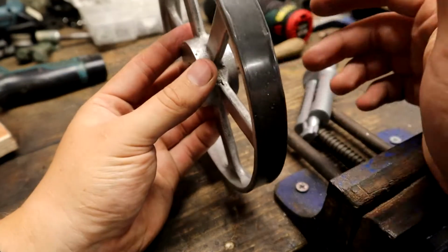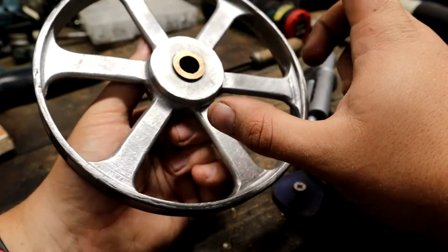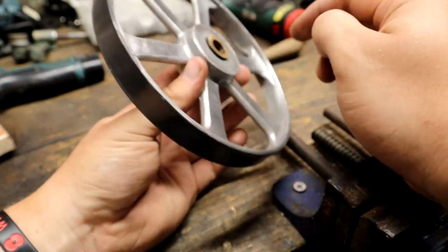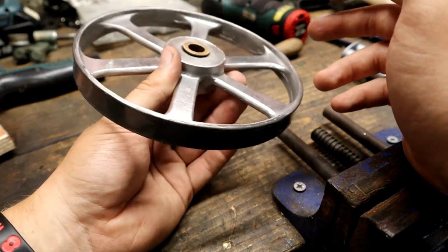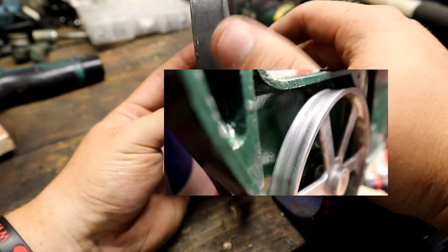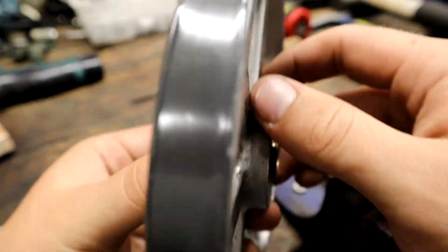Okay, straight off, previously on the first part of the restoration, if you want to go and see that, follow the link in the description, we started restoring these wheels. And just to give you a very, very quick update, this originally was designed for spiral bands, so they're spiral band cutting blades, and they're designed to cut in all directions, but they're pretty pants, so that's kind of why you don't see them anymore. And these had been worn really, really badly, because the spiral bands have eaten away completely a lot of the middle of this, causing a concave shape.